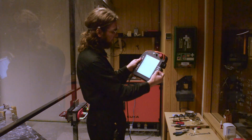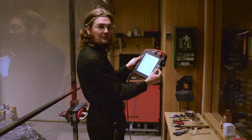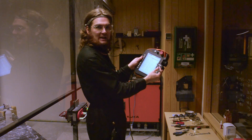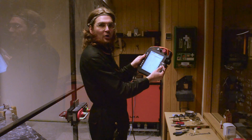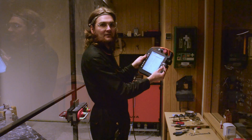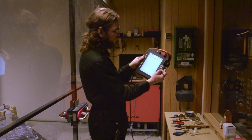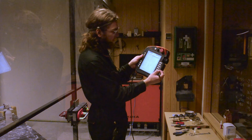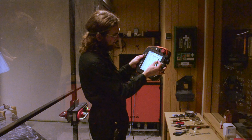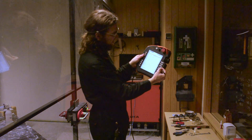I will showcase holding down the dead man's grip. You will see that these indicators will light up and you will be able to maneuver with the machine. Now you see that these are highlighted in green. These correspond with all six of the joints that the industrial robot arm has. For ease of maneuvering, we want to change the mode from local axis rotation for all individual joints to world axis positioning. We press the small robot arm icon here, and then change from axis to world. Now it's changed to world and we have XYZ here instead.